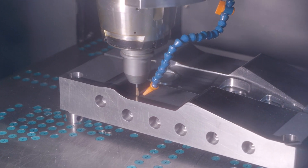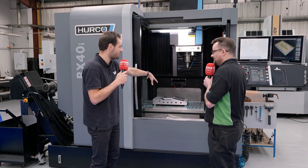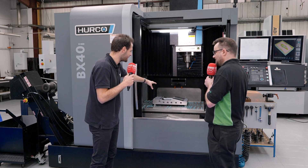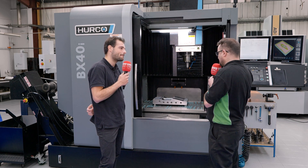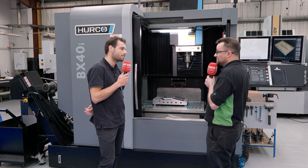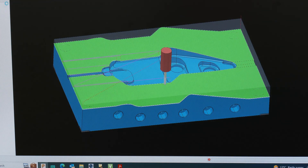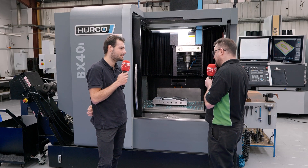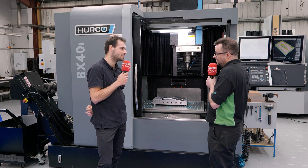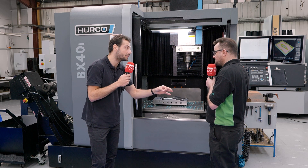If we look at the machine now, it's got this interesting corner-style door system meaning you can get the parts in. But the part right now isn't the biggest part you can get on this machine - we do cut aluminium car mat moulds in the machine which would be 900mm on the X and 600mm on the Y. So it's almost a metre by half a metre. If you programme them, maybe we're running for 20 plus hours - so long cycle times.